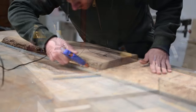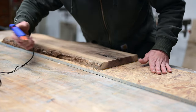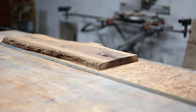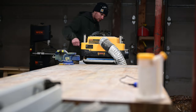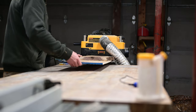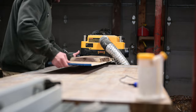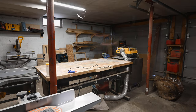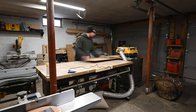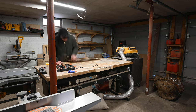The board was a little warped, so I used this kind of as a planer sled — hot glued it to a piece of plywood. This allowed me to really straighten it out so there wasn't a warp in there. Basically you run it through a bunch of times, then you're able to take it off, flip it over, and run it through the planer by itself. You've got a perfectly level surface.